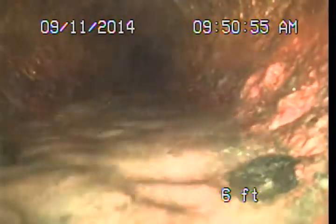As we drop in, we're dropping into a cast iron piping material. This looks like it's from when the structure was built. Now what we're looking for in these cast iron pipes is any evidence that the pipe is beginning to fail or that it would be at the end of its useful service life. I'm not seeing that evidence here. It looks like moderate rust and scale buildup in the pipe, which is pretty typical for what we're seeing here — late 80s piping.